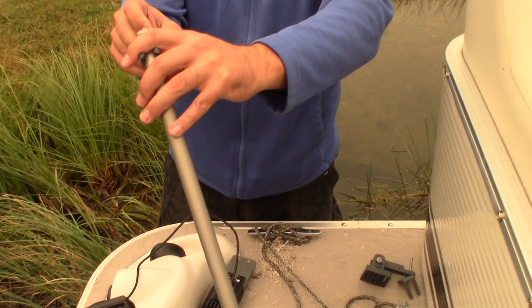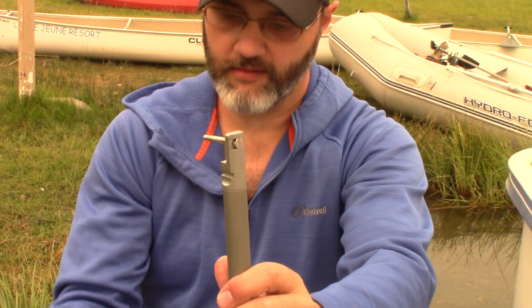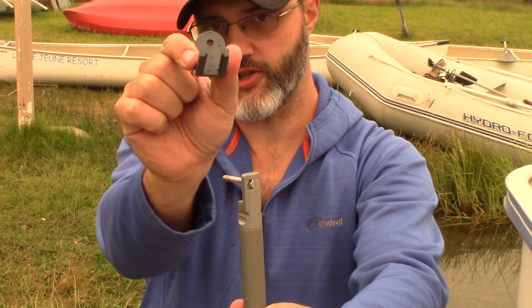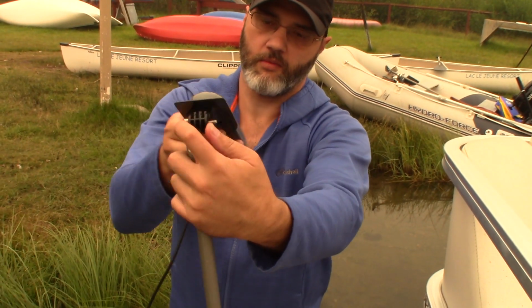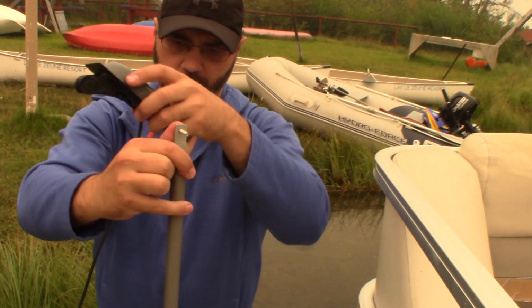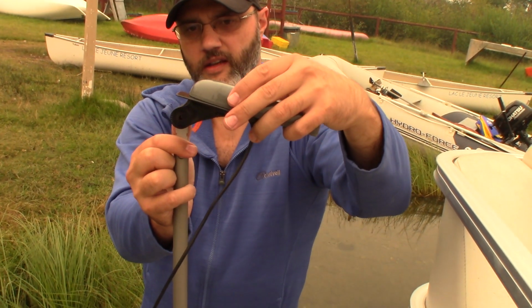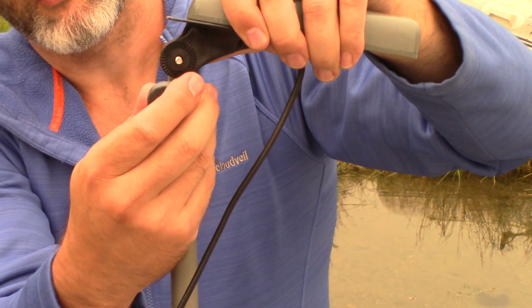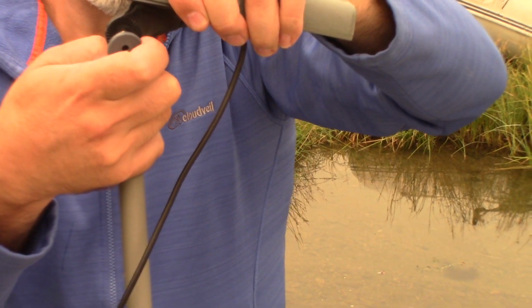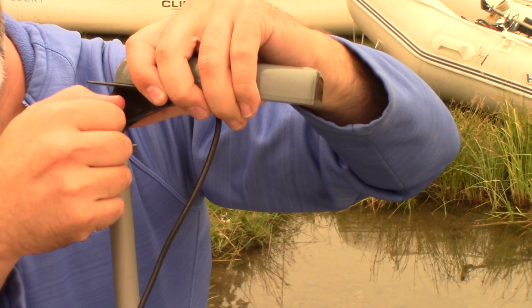You take this, the end of our pole arm transducer mount, and you slide this fork washer off just like so. There's grooves in the arm here that mate with the other part of this fork washer. And we just take this and we slide it on like so. I'll show that one more time so everybody can see that very clearly. You've got the hole there. You just take this, slide it on. You take your fork washer, you mate it up with these slots here. And it's on. And you just take your wing nut here and tighten it up.